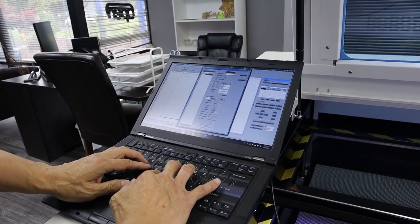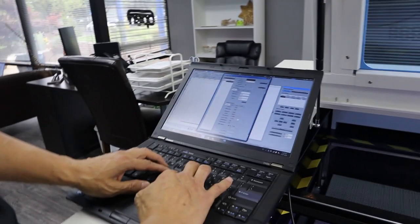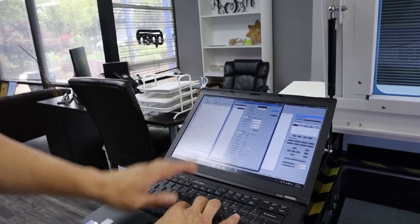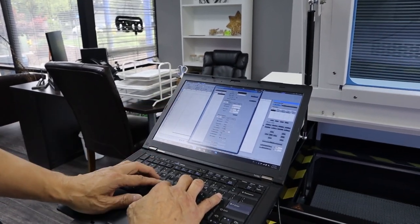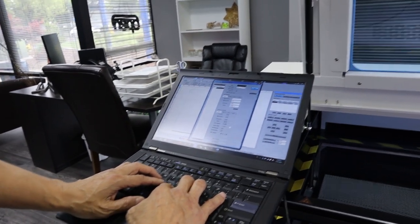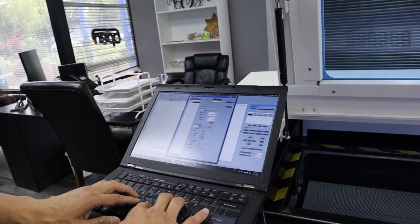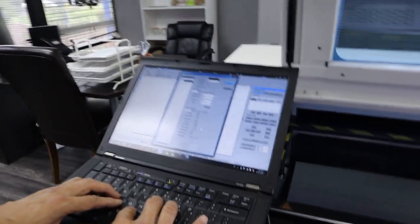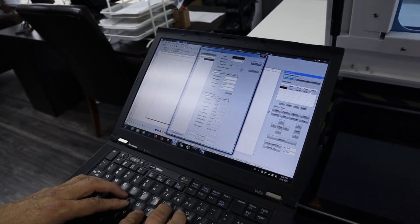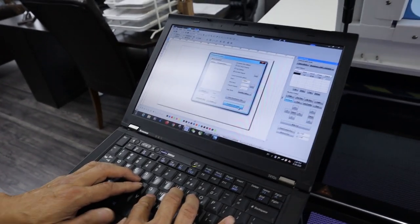Set up the speed — you don't want to turn too fast on the rotary, and don't use full power. I'm going to try at 7% power, minimum around 6 to 7.5%. Speed at 30 because I'm not trying to see skipping. Select Air, click OK, and download.